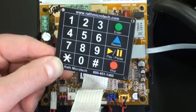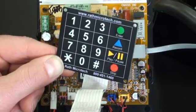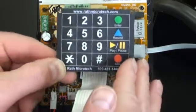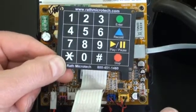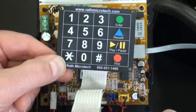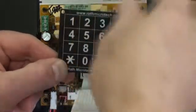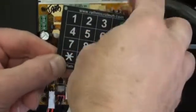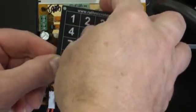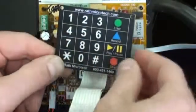SoundNet requires an 11-digit site ID. It consists of four parts: the first two digits are the elevator number, the next three digits are the branch number, the next digit is the service type, and the last five digits is the service contract number. To program this 11-digit site ID number, press two, one, enter. Now enter the 11-digit number, and then stop.